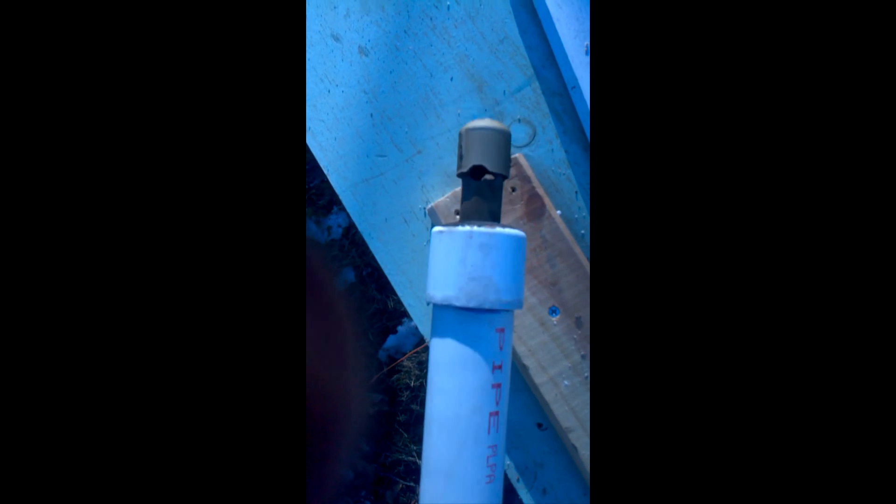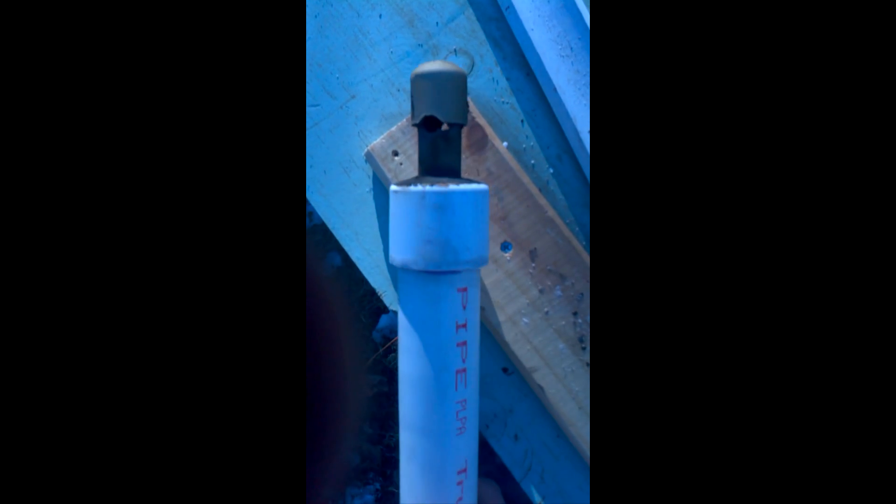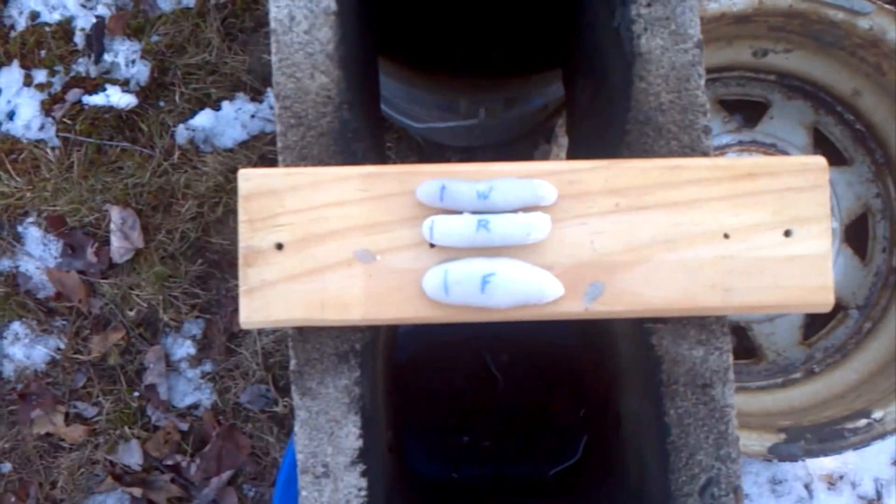I really don't know how to work around this. I'm finding that the bigger the motor, the more likely something like this is to happen. I'm considering going to a three-grain motor, which means I'll have to change the rocket configuration. The rocket weighs about 11 and a half pounds at this point. I'll give it another whirl — it'll take four or five days to cure more bulkheads. I'll inhibit the delay grain and see if that makes a difference. It's December, so this either gets off the ground soon or may be delayed until spring.